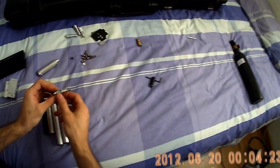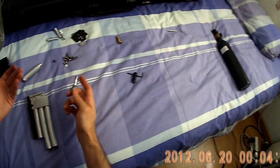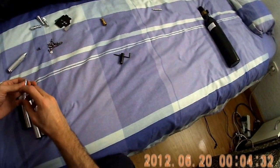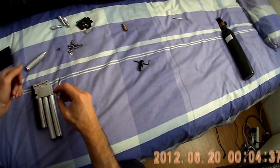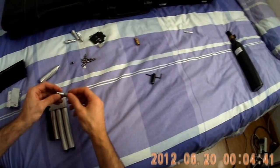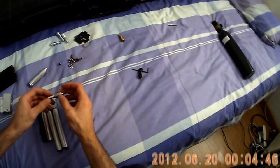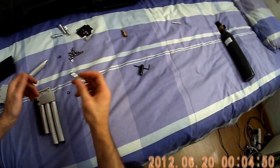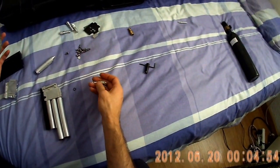This is the output valve of the magazine. It took me more time to get working because sealing it is pretty hard. It just needs a couple of O-rings — one in the front and another on the inside. On the outside, in the thread, it just has some teflon tape, which works. It's not the best solution right now, but it works.